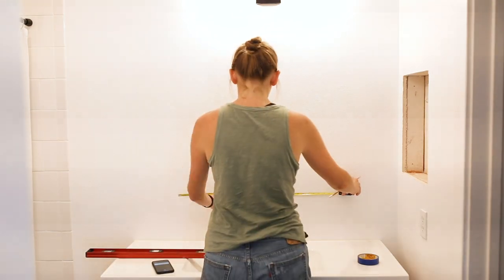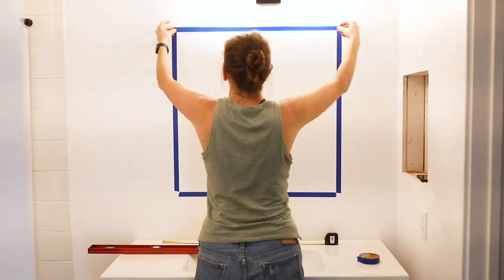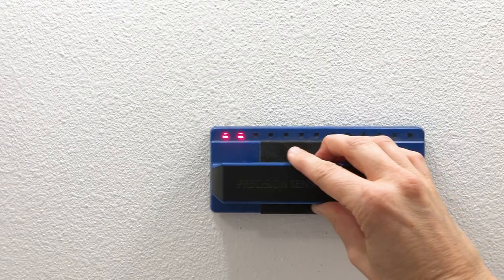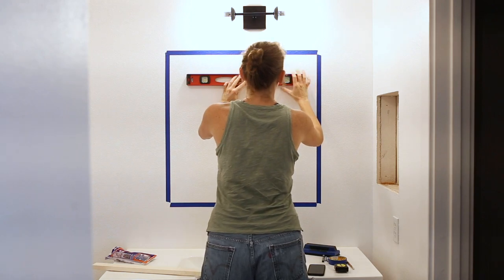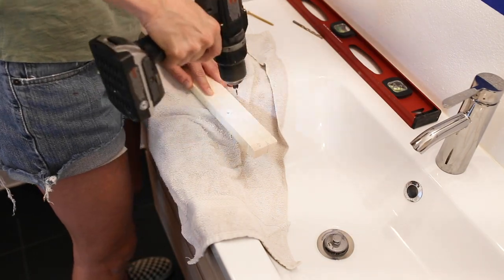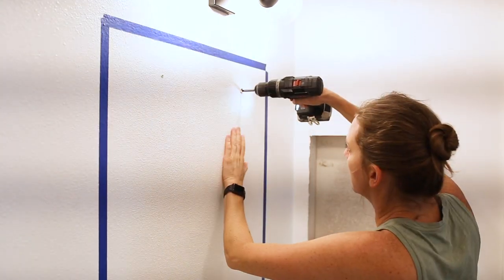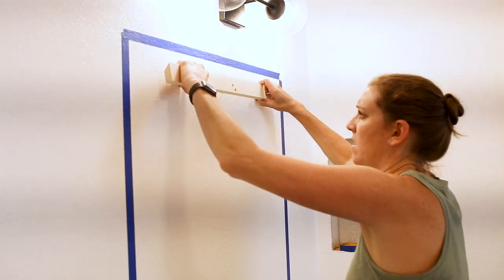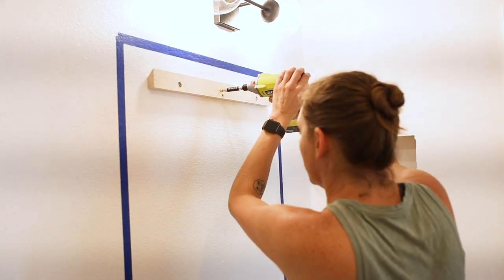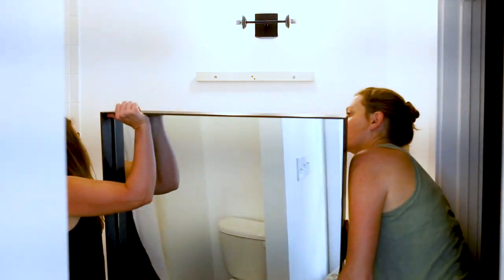And finally, on to hanging this up. I measured and found the center of the vanity the mirror is going to hang above, and then I mapped out where I wanted it to hang with painters tape. Within the taped outlines, I took my stud finder and found the studs for the wall side of the French cleat. I then measured where I wanted the cleat to hang and pre-drilled for the screws. I unfortunately had only one stud available where I wanted to hang, so to make up for this, I got some heavy duty wall anchors. Here you see me pre-drilling for the anchors and then attaching and securing the cleat to the wall. I used three inch screws to attach the cleat to the stud. And with the cleat in place, it was time to hang.